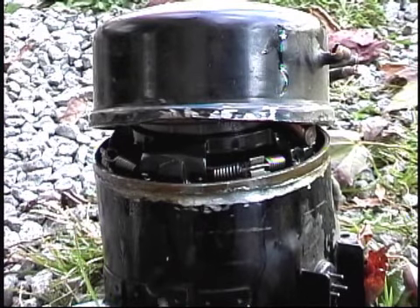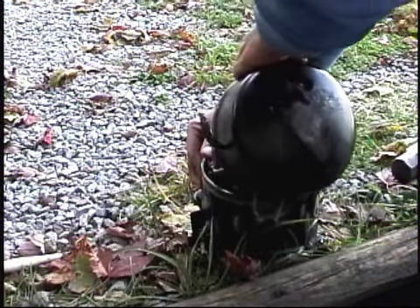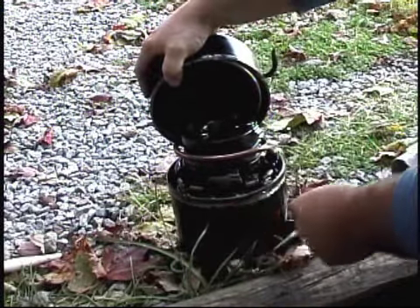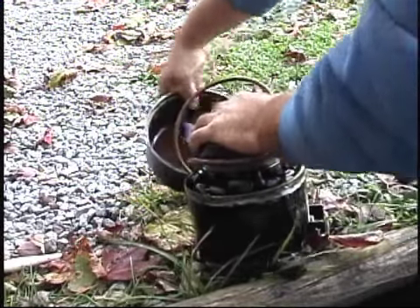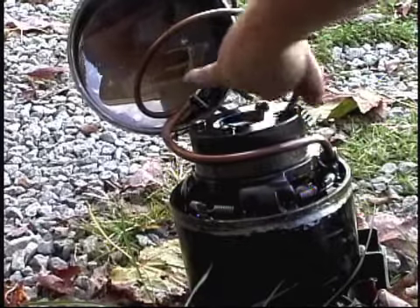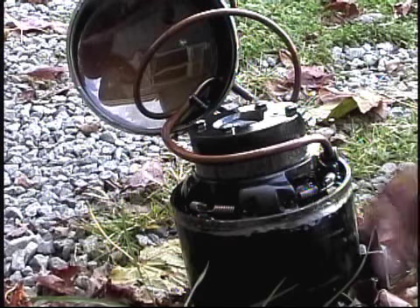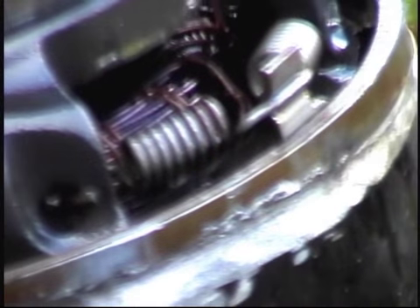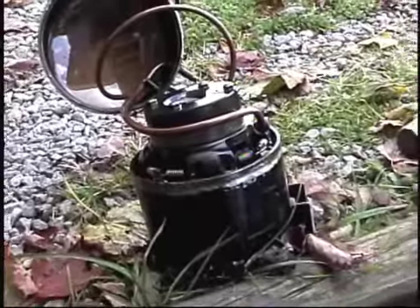As you can see, I got her cracked. Now crack this baby open. Windings look awfully dark on this. If you look right here and up around the other side, that's where those extra tubes went to — they were just in the side of the compressor. I'm going to go ahead and yank these two lines off. If you take a look at those windings right there, they're really dark, but yet this thing still hummed. If I didn't mention it, this was an R12 compressor out of a Whirlpool refrigerator.